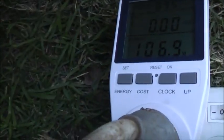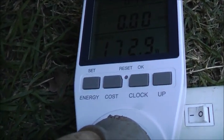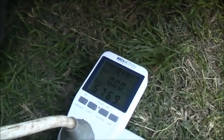One other thing I'll point out with these, the other one and this one are both 10 amp units. These aren't 15 amp rated units, so they both came originally with the 10 amp plug spec, so to speak. So they're not so big. But we'll do a test and see how much power it uses. On the vacuum, fan high, compressor, 1100 watts started, about 600 watts on the vacuum. It's under no load, the motor inside doing nothing.